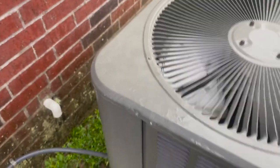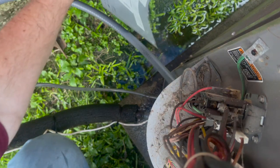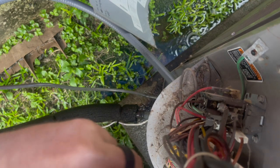I don't think I heard a compressor. I might as well go ahead and knock this out — let me grab my tool bag. We're definitely going to have to knock this out now because I just looked at the radar and the weather's just going to get worse the later it gets. I've got my tool bag and umbrella — get this cover off. Oh, this is a heat pump, which is surprising — you normally don't see heat pumps in this area. But that thing was blowing ice-cold air. Can't even see the capacitor size — it's a 40 plus 5.